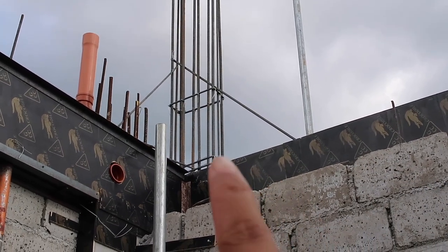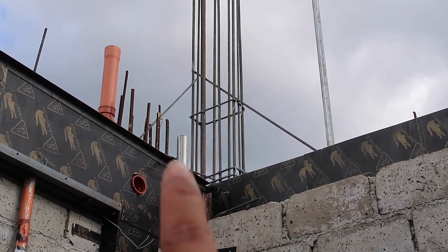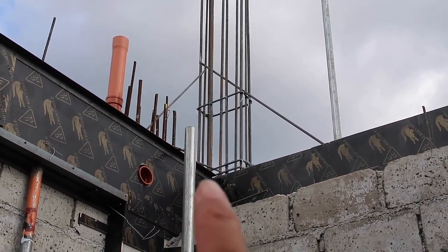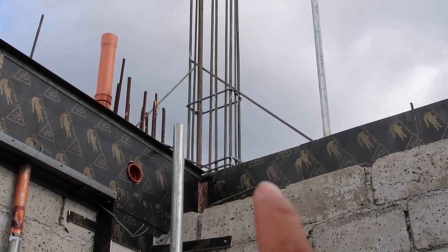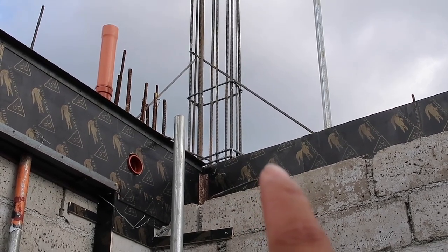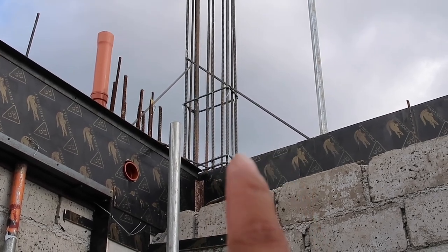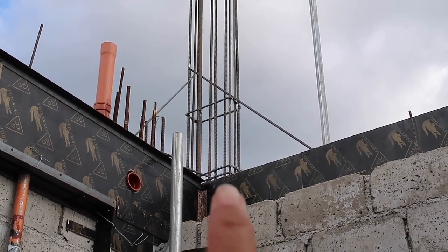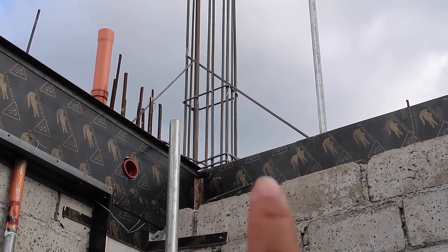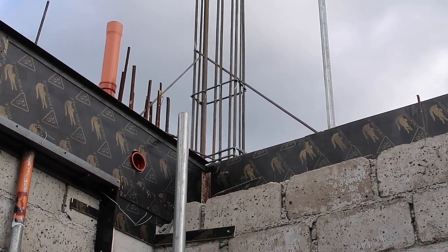It will be 45 centimeters that way and then 45 centimeters this way, and they will still use at least 10 rebars — which is 8 of the 16mm and 2 of the 12mm. So we don't have any nosing sticking out for our bathtub, which is a great idea because we don't want to waste space or have a gap from the wall because of the nosing sticking out.